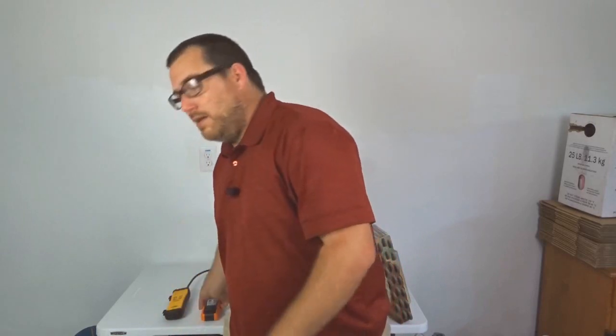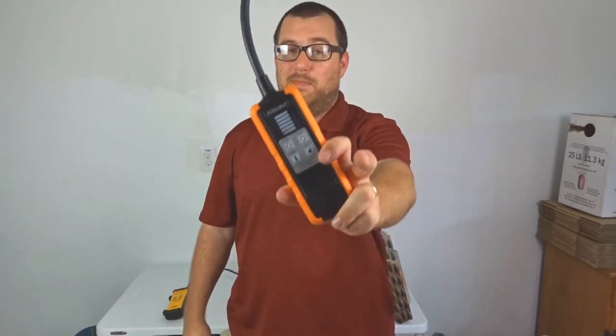This test turned out a little different than the last one — I thought we'd have the same leak detectors passing through the third round, but that was not the case. The definitive winner, in my view, is the NAVAC NML1. It doesn't look like much, but it won this round definitively. I was pleasantly surprised at what an affordable leak detector can do against 410A. The other one I'm putting through to the second round is the Fieldpiece SRL8, though I really don't think it was anywhere near as good as the NAVAC.